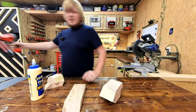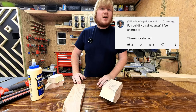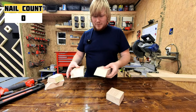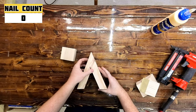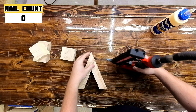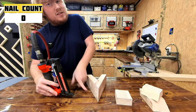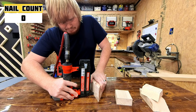We are going to nail these bad boys together. I am using an 18-gauge inch-and-a-half nail just because this is really thick material. We will put a nail counter up on one of the sides — if you comment, I'm pinning it to the top. Now we are going to take these — I'm right-handed so I'm flipping them around. Let it set for just a minute or two, then line up the tops. Move things out of the way to minimize casualties, put a lot of force down so it doesn't slide. I start with shooting a nail into the bottom because I'm putting a lot of pressure — safety.